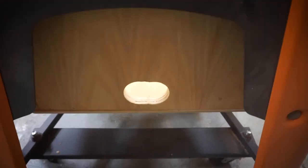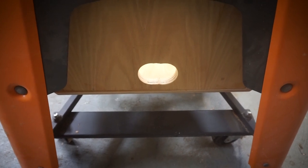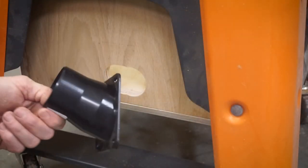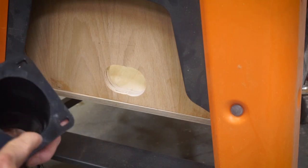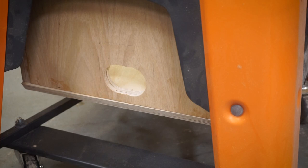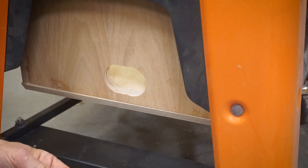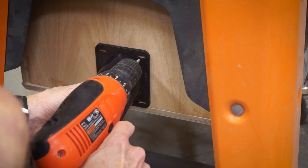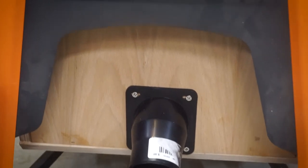What I did at the back is I used a Forstner bit — a 2-inch Forstner bit — multiple times to drill a hole. Now I'm going to attach the dust port over that. Here's the dust port. I'm going to angle it down like this and try to align the bottom of the opening of the dust port with the bottom of this hole — right about there. I've got some No. 8, 3 and 1/4-inch screws, which will be good. All set — it's ready to be used.